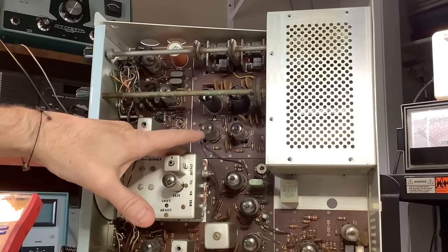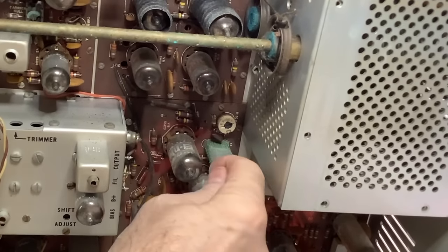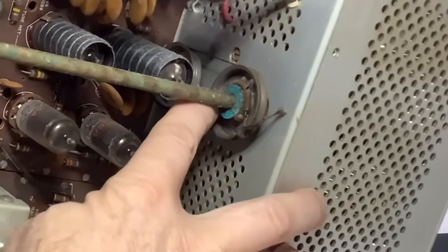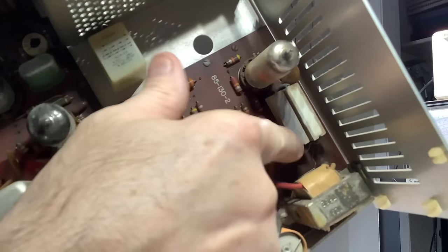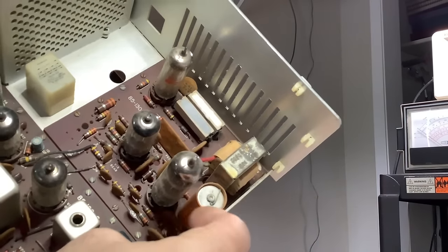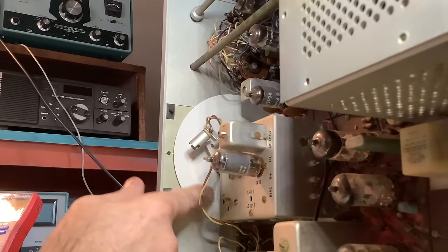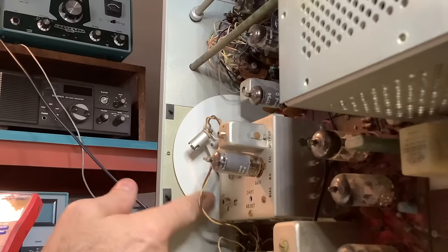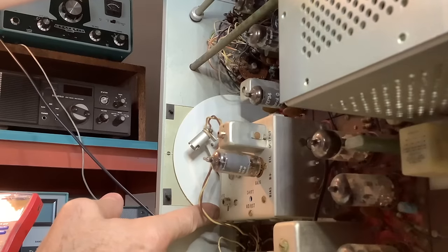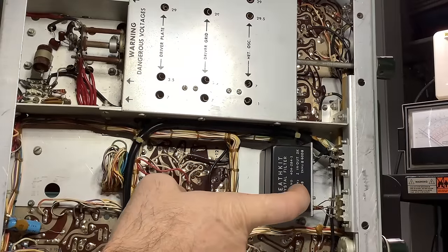It's not as bad as I thought. You can see the calibrator crystal is all coated with tarnish. This shaft is pitted with green tarnish and even the inside of the pulleys — look how bright green they are. These wire wound resistors were mounted upside down; I don't guess that's a big problem. And of course I'm going to want to remove any paper caps. One interesting finding: this plastic dial looks almost brand new, there's no yellowing at all. Really happy to see that it has a CW filter — these are becoming very hard to find.